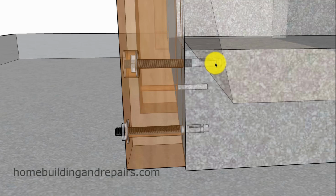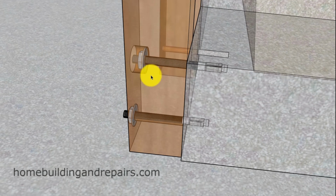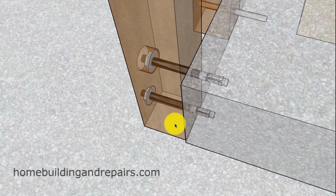This isn't going to work as well otherwise. And I've seen people, this requires a 1/2 inch hole for a 1/2 inch anchor, and all they have is a 5/8 bit. It's just not going to work. I shouldn't say that. You might be able to figure out your own way for it. Always follow the instructions. I like to go with that.